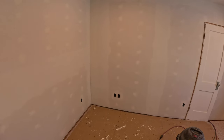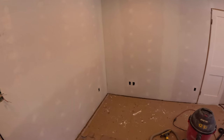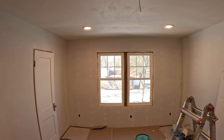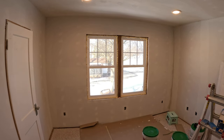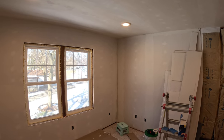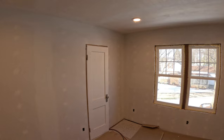The bottom half of that corner looks like it's pretty good. Once it's dried, just hit it real quick again with one of these little sanding blocks and it should be pretty much done. Other than that, I noticed there's one screw hole over here that needs a little bit more mud, and maybe another screw hole here and there. We're looking pretty good. I don't think it's really worth cracking open the mud just for two or three little spots. We'll come back and get them before we paint. I think that's going to do it for this room and for the drywall.